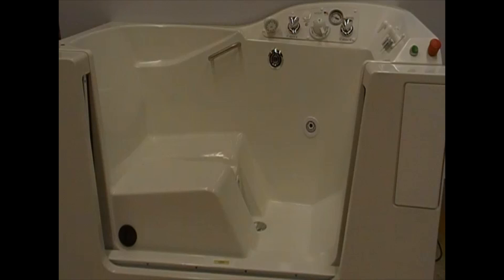It is important to note that the door operating system has a built-in safety feature to prevent the door from closing should something come between the door and the door opening — very similar to the safety features on your electronic garage door opener at home. This safety feature is very sensitive and can be triggered by a door that is either adjusted too tight or a misshapen door sheet from storing the door in the down position for long periods of time.